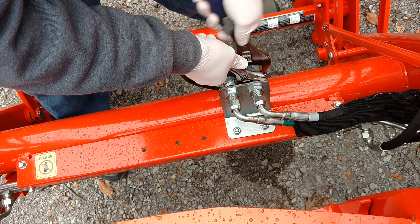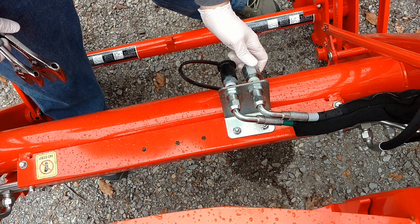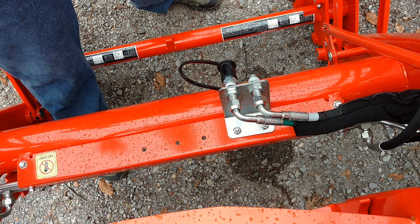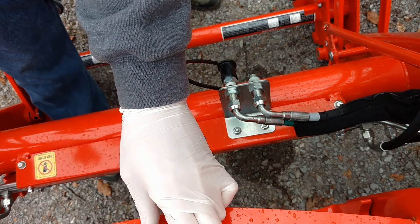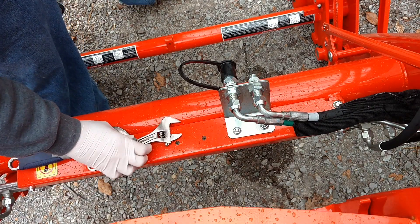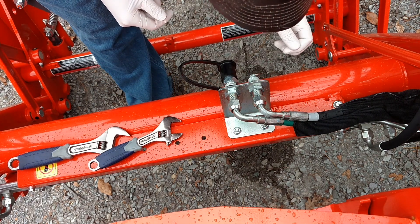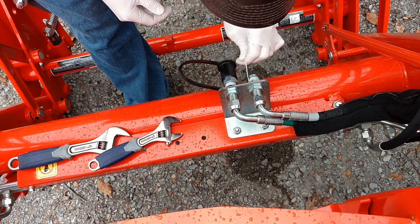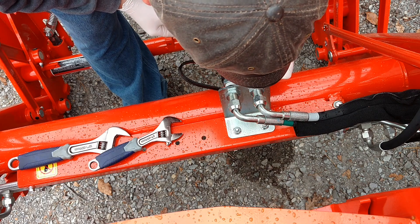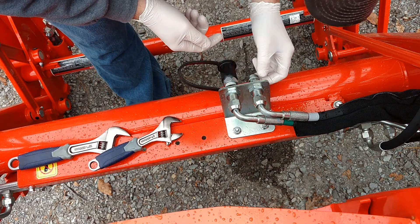Once you get the caps off, you can see a spot on the gravel from where I took the previous one off. You're going to get some hydraulic fluid to come out, so be prepared to catch that. There's not a whole lot, just a small amount. Coming from the dealer, it did have Teflon tape on there - Teflon tape isn't something you want in your hydraulic fluid, which is why I peeled it off. It can plug things up and make for a bad day.